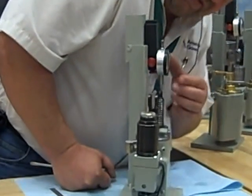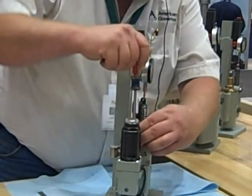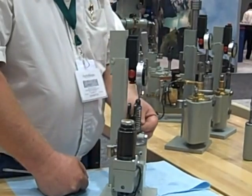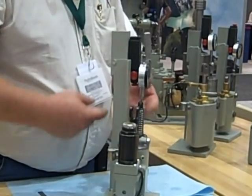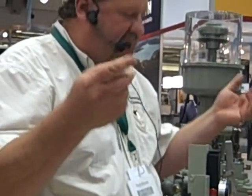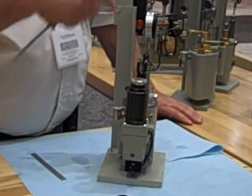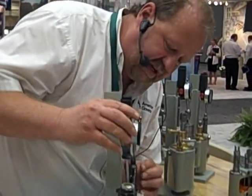What I'm going to do is deflect the needle. We're going to move this down 150 thousandths of an inch. Then we're going to measure the amount of time it takes to return 100 thousandths of that — so two-thirds of the way, one time constant. What we're looking for is at least 30 seconds. Let me do this once real quick and we'll do it several times so it makes sense.